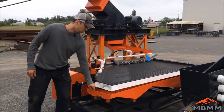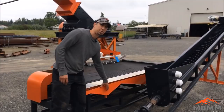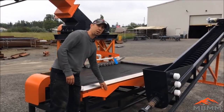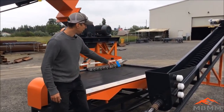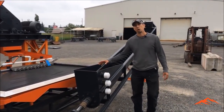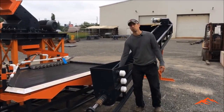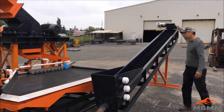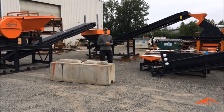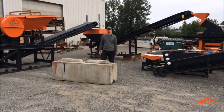Down here into number one and number two concentrates. There's a number three concentrates bin here where most of your sulfides are going to go. There will be a splitter in there that you can adjust the cutoff between the number three middlings and the number four tailings. The tailings will flow down into this spiroclassifier where the heavy material and larger pieces settle down through this basin and get augered and dewatered. I hope you guys enjoyed the video of our two-ton-per-hour walkthrough, and let us know if you have any questions or comments — you can give us a call or email us, all of which is in the description below. Thanks for watching, and we'll see you on the next video.